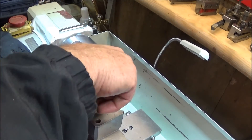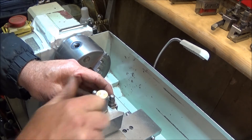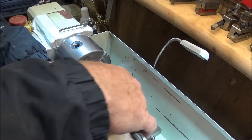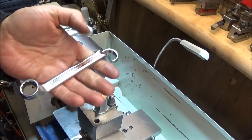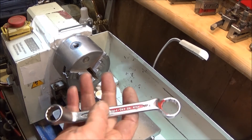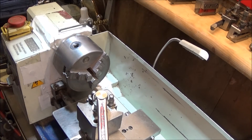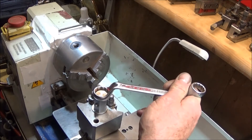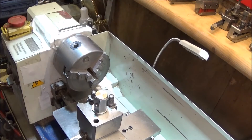This is a great upgrade for me. Because I've got both lathes, I've standardized the nut so it's the same on both, and it's quicker to use with fewer tools. Also, using a ring spanner is much safer with less chance of slipping. Before I go, I just want to show you the tailstock of the mini lathe and an upgrade I've done, which I hope to do a full video about soon.